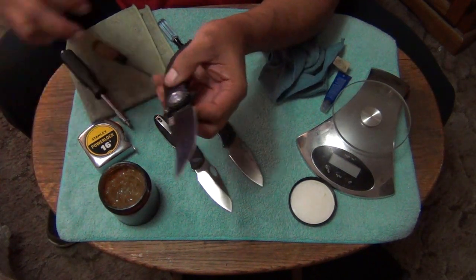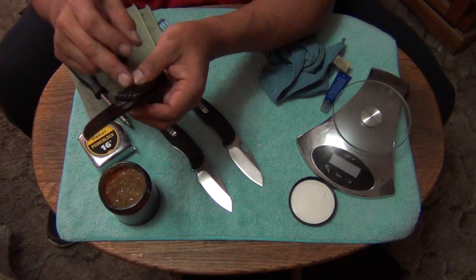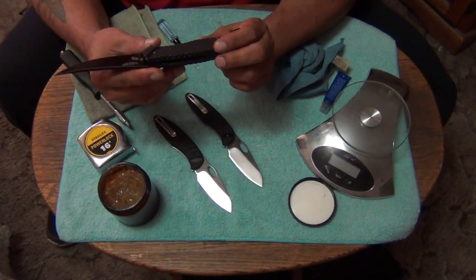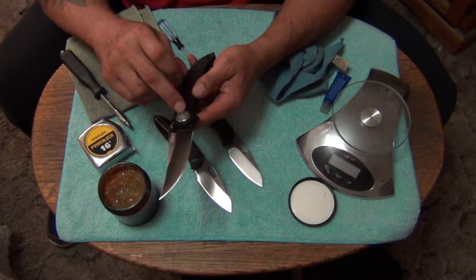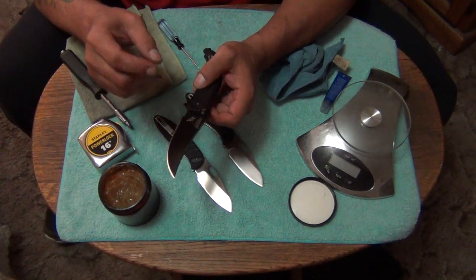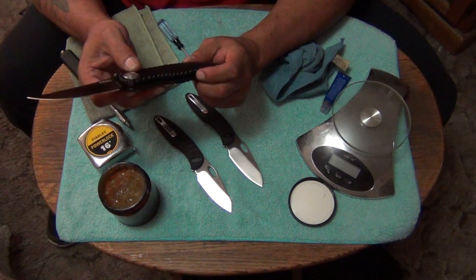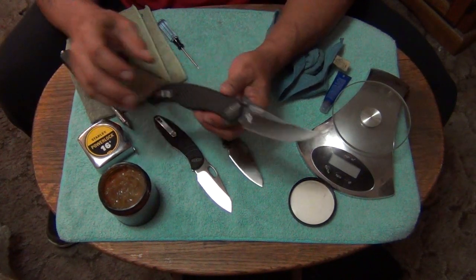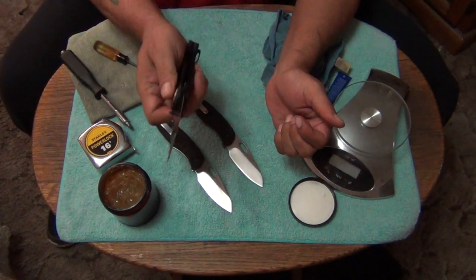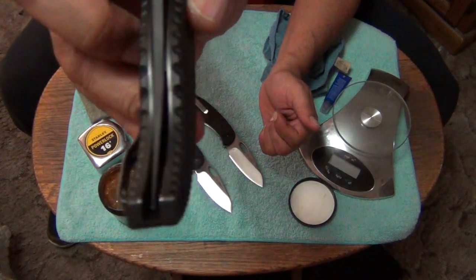I don't know if they're going to improve it. I think the way to improve it would be to make a stronger conical spring. And the way to improve the pivot from coming loose would be to make a D-shaped pivot screw so it couldn't come loose. I think the deadbolt's flat side needs to be a little bit thicker to accommodate more threads so it holds together better - especially after you put red Loctite on it. But other than that, I absolutely love these deadbolts. They rock.